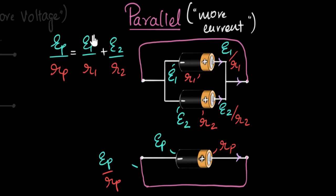This equation represents the total maximum current the effective battery can deliver, equal to the sum of the maximum currents the individual batteries can deliver. This is why in parallel you get more current — connecting them in parallel increases the maximum current available. To ensure the currents add up rather than cancel, attach batteries the proper way: positive connected to positives, negative connected to negatives.